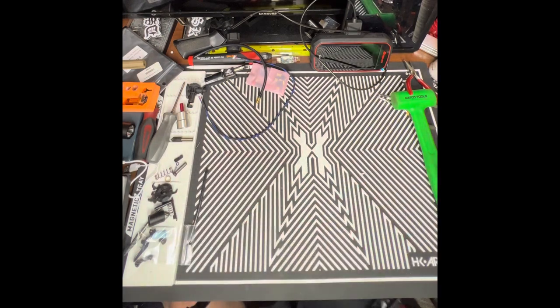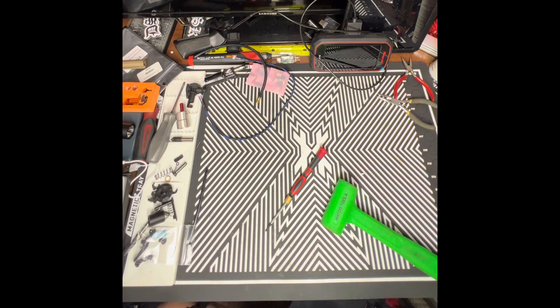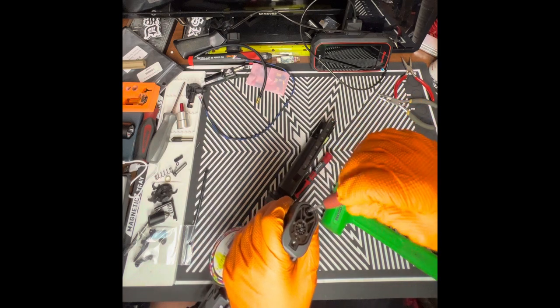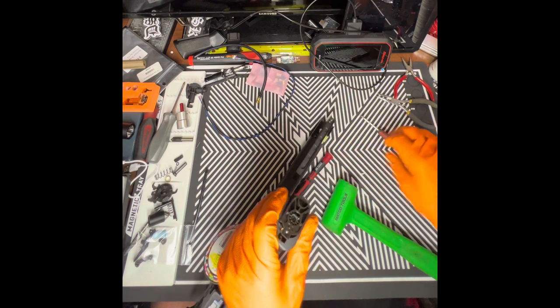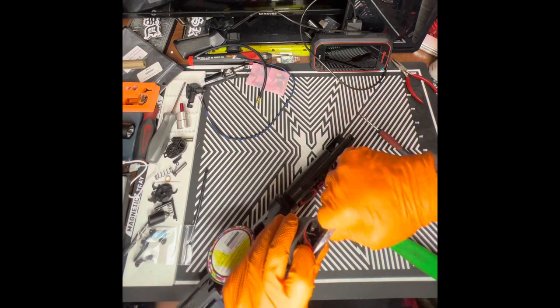That was really tight. I'm going to put it in my lap. That baby right there is tight. Thank you, GNG. I think she may use the fixed one because that one's slipping. You heard that pop? That's how tight it was. But Torx bit grabs the Allen way better than an Allen. If you feel it slipping, I'd go ahead and get the Torx bit out. And that'll save you a lot of aggravation in the long run. I promise you.